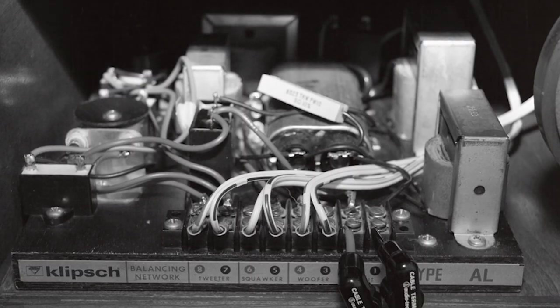The Double-A network used a lot of the same parts through the different network iterations. The T2A transformer was the way to get one transformer to fit all the different step-down values for the different midrange horns. In 1983, the AL crossover came into play — they steepened the slope and changed the filtering for the tweeter.